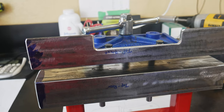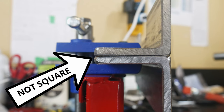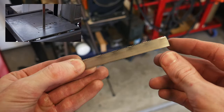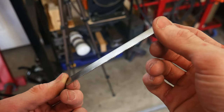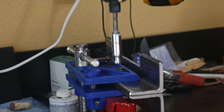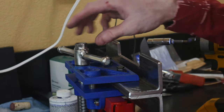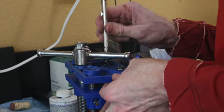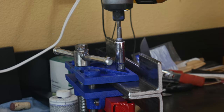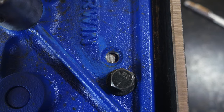At this point, we're about 90-95% done. I did notice that there is a gap where it is not square between the two plates, which is due to the cheap construction of the woodworking vise. I just so happened to have a piece of bandsaw blade from my last broken blade, so I used this piece as a spacer — and lo and behold, it was actually the perfect width to make these plates meet up in a square assembly. You can see the teeth of the bandsaw blade spacer when looking at the vise from above.